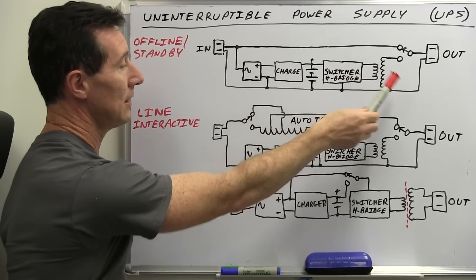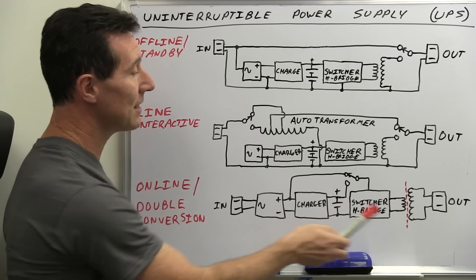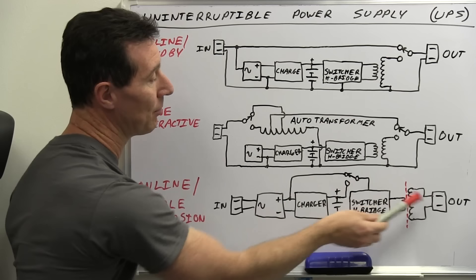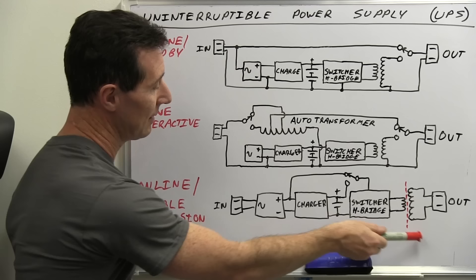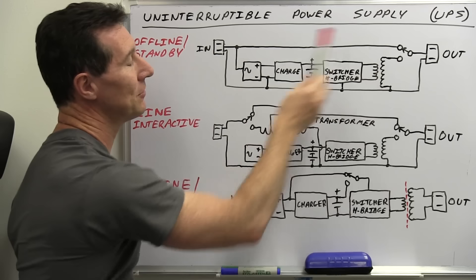All the common components are still there — they're virtually identical. We've got our AC rectifier, our battery charger, our battery, our switcher with our step-up transformer to generate either sinusoidal or square wave output. But there is no switch connecting; it can't bypass any of this stuff — it's always working. Instead of switching from input directly to output, we're switching basically whether we want to power the output from the battery or from the rectifier. One of the main reasons is isolation — there's no direct electrical connection from output to input, i.e. it's galvanically isolated. So if the device you're powering needs electrical isolation, an online or double conversion type is the way to go. But in the offline type, even though there's a transformer, it's all common from input to output.